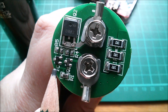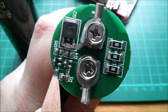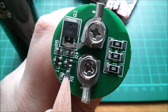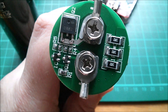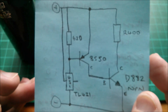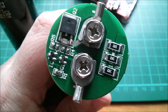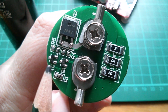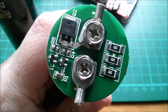This one is entirely different. It has a little TL431 — a sort of voltage reference with a big switch on it and a comparator. If the input goes over the voltage reference it turns on. It's also got a PNP transistor and a big NPN transistor, and there's the little blue LED I soldered on, but that's not going to do anything. I've actually started to sketch out the circuit, and I'm going to reverse engineer and test this, put some DVMs on it, get some voltages, and try to get an understanding of how this is working, because I understand MOSFETs more than bipolar transistors — so this could be quite fun.